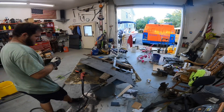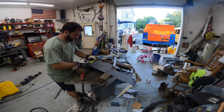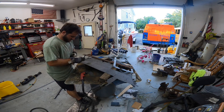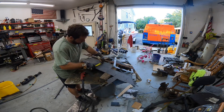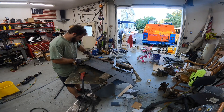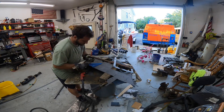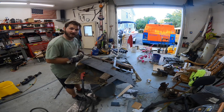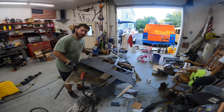I still have to weld everything solid and grind it smooth, but there's little things here and there that gotta be fixed — this is rough. So now working on filling this little gap and this gap. I'm gonna weld the plate higher — I wasn't sure so I made it a little shorter, but now it's gonna weld higher and mount to here, and this is gonna be one big removable piece. So let's cut a piece for there and there and weld it in. We got the next piece — 12 and three-quarter by six and a half. It is hot in here, just about 100 degrees today.